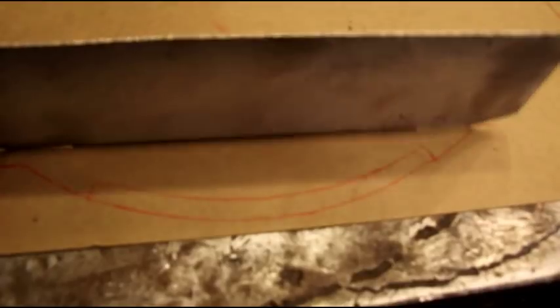So let's head over to the kick shrinker, and we will shrink that little flange around and work this wide section, and we'll start to get that bent around to that perfect curve that we need. So we'll just do a little bit, and then we'll keep testing it on the pattern here, and we'll just go back and forth until we have it bent around there perfectly.